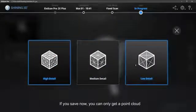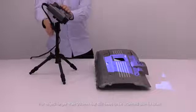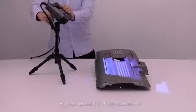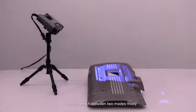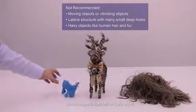If you save now, you can only get a point cloud. To get mesh data, you need to mesh first. Check rapid mode for mesh setting. For objects larger than 200mm that still need to be scanned with fixed scan, you can uncheck the turntable to scan. Having at least one third of the same scanned area with the former scan allows you to successfully align. You can switch between two modes freely. Transparent, reflective, or some dark objects cannot be directly scanned — spray powder may be required. Do not scan soft or fluffy objects.